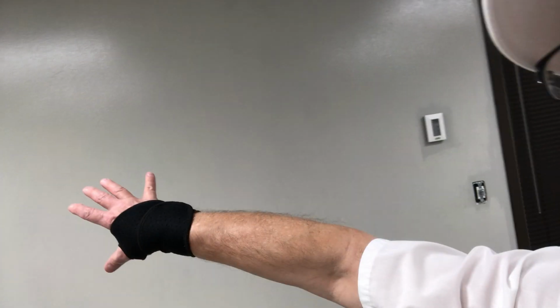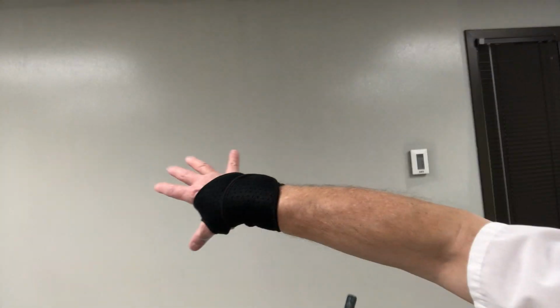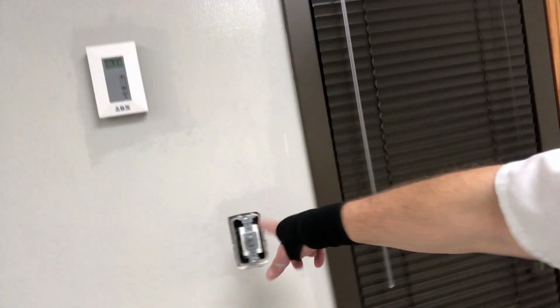So here's the wall I just got through doing. It's the bigger wall that I didn't know if I could get the camera to show you everything. I cut in around the thermostat, around that. I brushed in between there a little bit. I cut in and brushed above the door instead of doing my roller in there. And I did this little spot right here. Someone, not me, got paint on there because they were going too fast and didn't care.